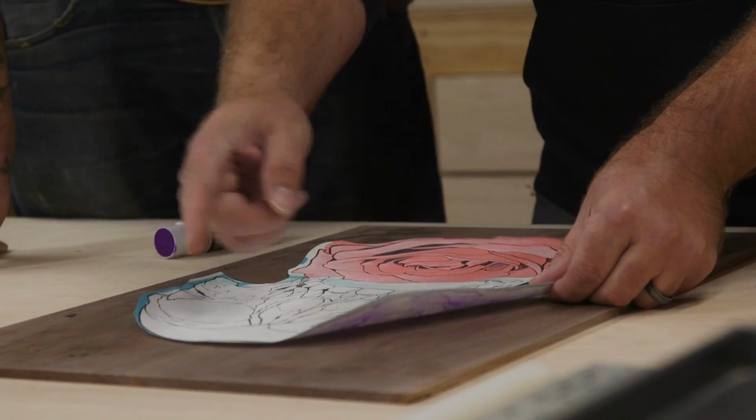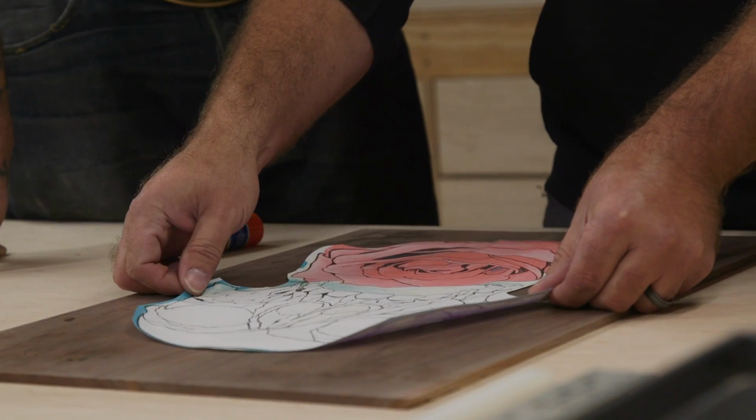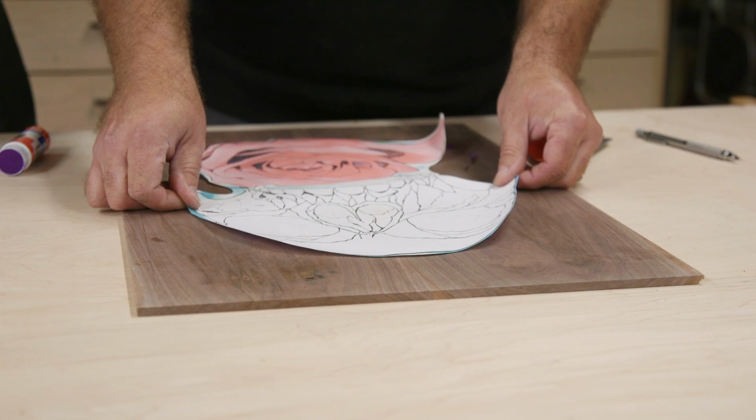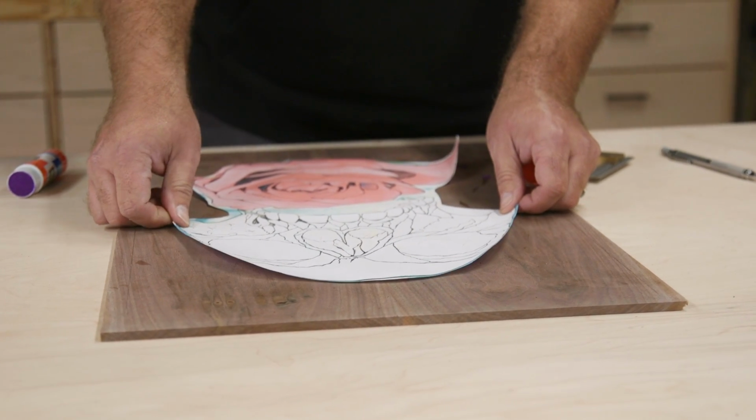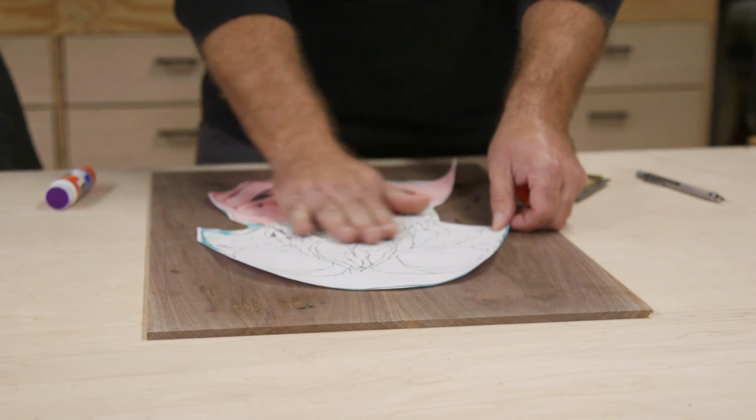walnut, so we know that we have a center line where the book matching is. And then we know that we got plenty of side room. And book matching is just taking a slab, cutting it in the middle, and then spreading. Yep, opening it up like a book so that it looks identical side by side. So your grain matches. Yep.